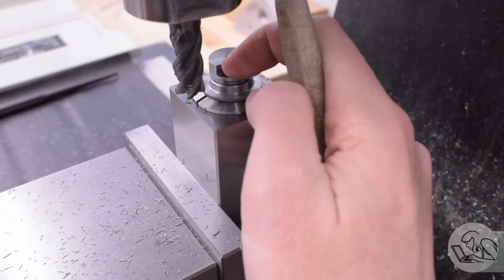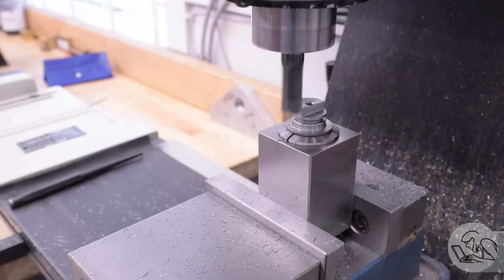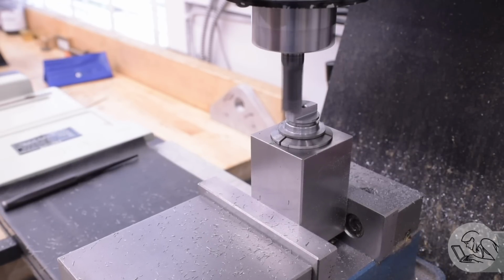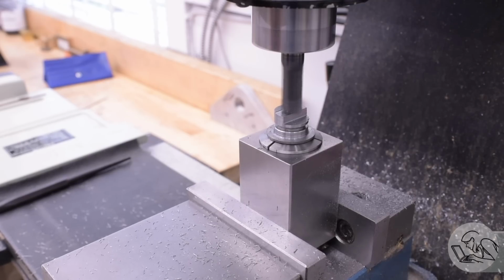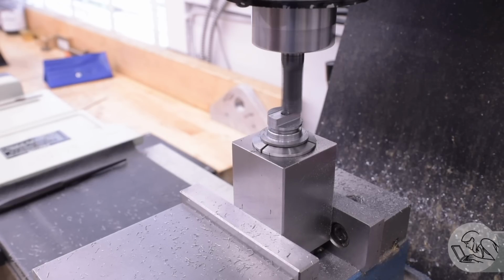There's the clamping shelf. Once again, the dimension on that was pretty important because that's going to determine how smoothly it clamps. And we have another very shallow shelf that's cut along the top. And this creates a clearance to create a kind of toe clamping or strap clamping action on this piece. I'll show you how this works when it's done because it's pretty neat. But for now, just know that I need to create a very shallow cut.